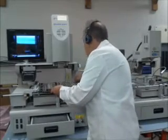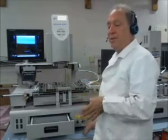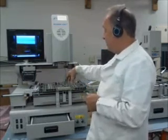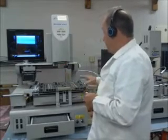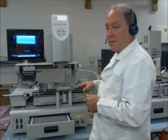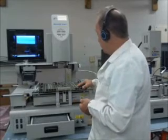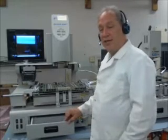At the highest point on the bottom side, we were getting up to 180, and the top was about 150. So overall most of the board was about 98 degrees, but the area near the nozzle gets hotter. We're dealing with lead-free solder that melts at about 220, so I'm not really worried about 180 or 200 board temp as long as I don't have any lead solder on the board. So we had a successful install — it went good. Hope you enjoyed the video and thanks for watching.